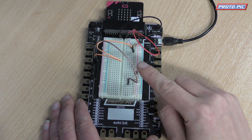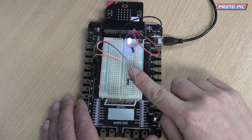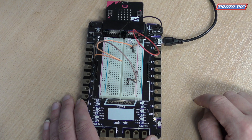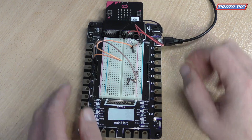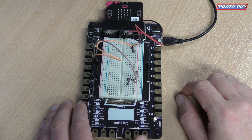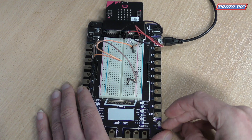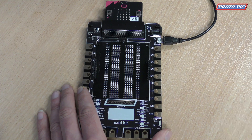So this is a nice simple one with an LDR — when it gets dark, the light should come on. So if I cover this up, you can see the LED lights up. And that's all very well and good, but it's quite bulky and messy. Your wires can easily get pulled out. So once you're happy with your design, if you were to switch this off and unplug these headers, we'll remove the breadboard.